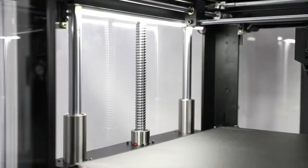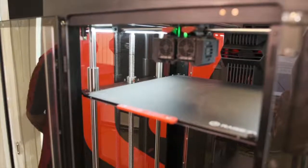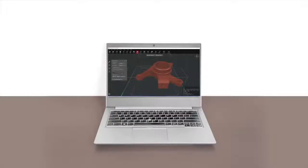The Pro 3 features larger Z-axis smooth rods, allowing for a more stable printing surface and more consistent large scale prints. The Pro 3 is already included in Raise 3D's printing ecosystem with profiles pre-built into the latest version of IdeaMaker, as well as the online IdeaMaker library for future templates. It's also compatible with Raise Cloud for full remote operation and includes the features familiar from the Pro 2 series for power loss recovery and filament runout detection. The Pro 3 also features a similar dual extruder system to the Pro 2.